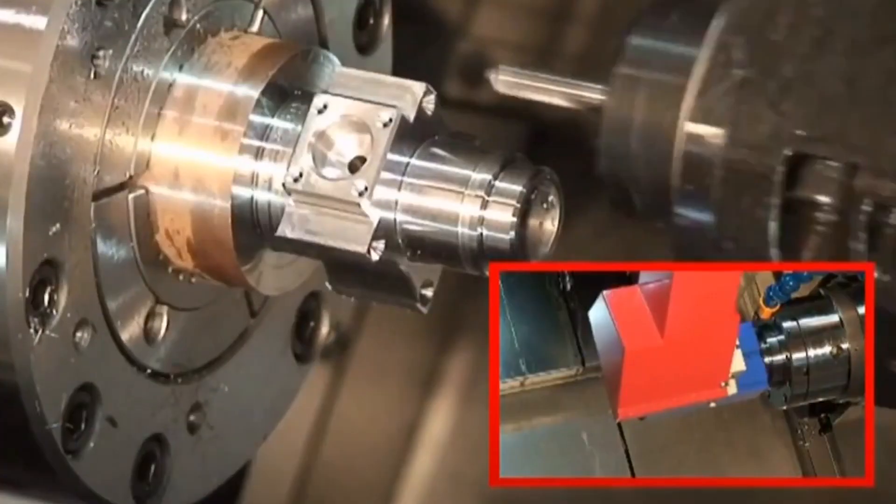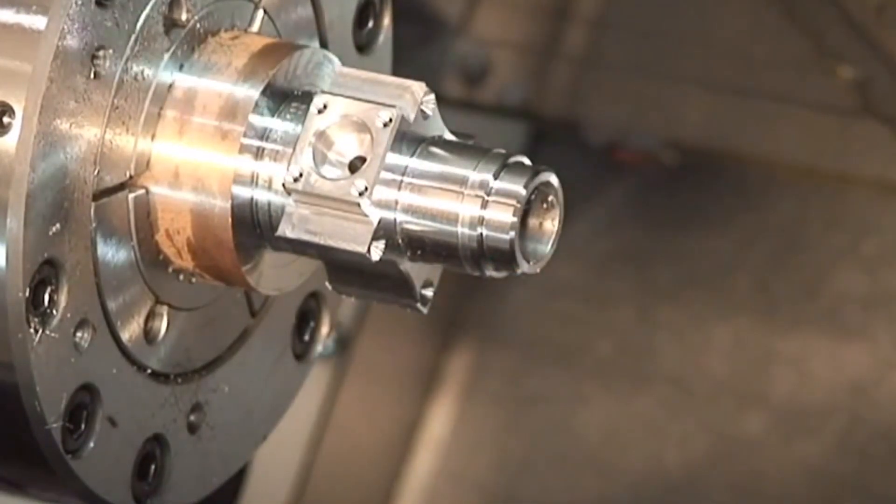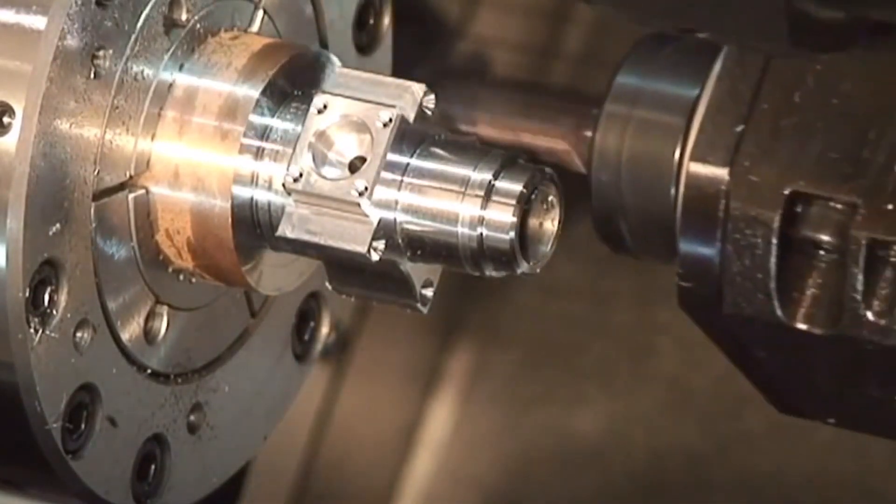It's a big, solid, one-piece casting — so it's going to handle big cuts. It's a twin spindle machine, triple or double turret. It's a one-piece solid casting which is hand scraped — even still today — making it a highly accurate machine. I've got customers that machine to microns over a 24-hour unmanned period on a big 12-ton machine. You've got the option of twin turret or triple turret, all with Y-axis and revolving tools.